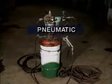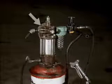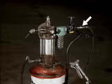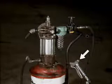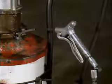Many facilities have pneumatic or air-powered grease guns. This air-powered dispenser consists of a pump that fits on a grease drum. An air hose connected to a source of compressed air supplies air to power the pump. The pump moves grease from the drum through a hose to a grease gun connected to the end of the hose. A trigger on the gun is operated to release grease. Be sure to check your plant procedures when you're greasing a bearing — they may tell you how much grease to apply and whether the equipment needs to be running or not.